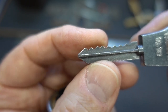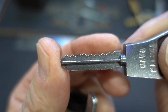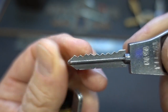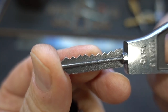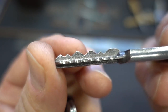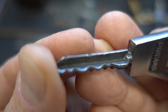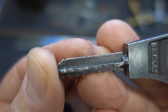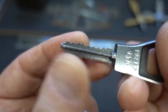I counted these. I don't think that there are eight pins in this lock — there may very well be. I haven't played with it very much, but you can see there are grooves for eight possible pins. I'll call that the top, and on the right side — you can probably rake that. On the bottom, there may very well be eight pins, but I only see very tiny cuts for three pins, so there may only be three. I really don't know.